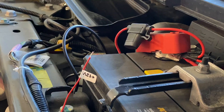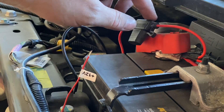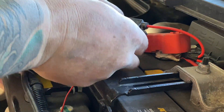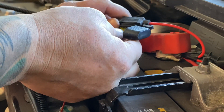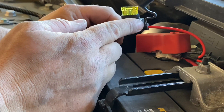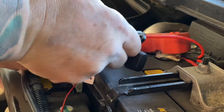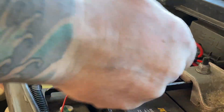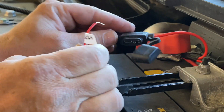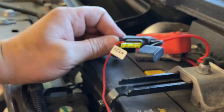For the power, we take the fuse — this is the fuse for the electric trunk. Open it up, take out the fuse; the part that goes to the battery is not the terminal you'll use. We're going to put the wire in the left terminal — the one going out — insert into the left terminal like that, then put the fuse back in. Now it's locked in place by the fuse.